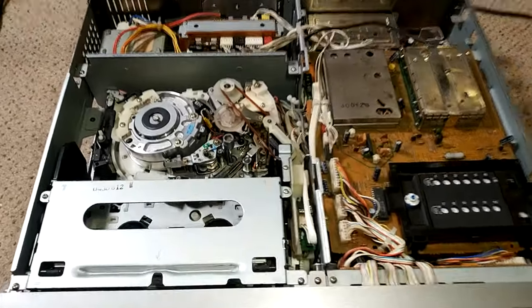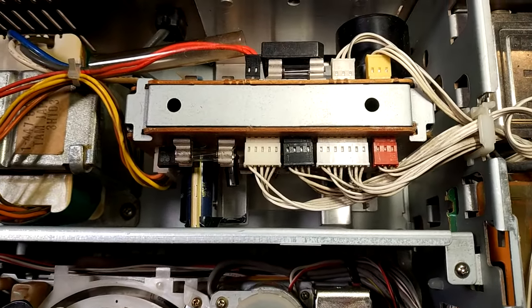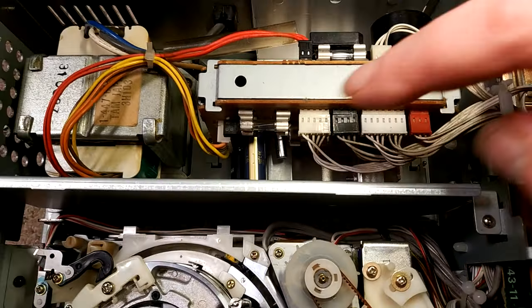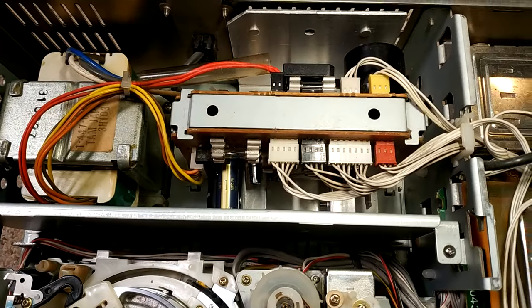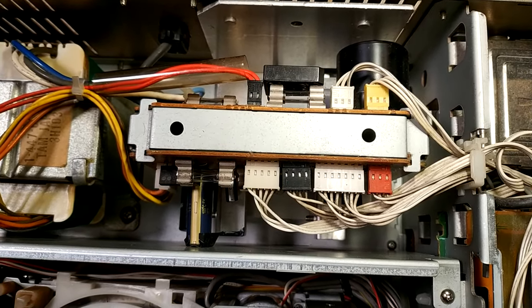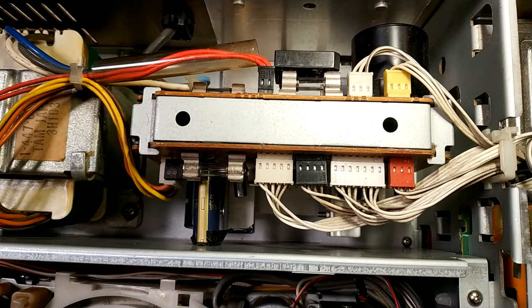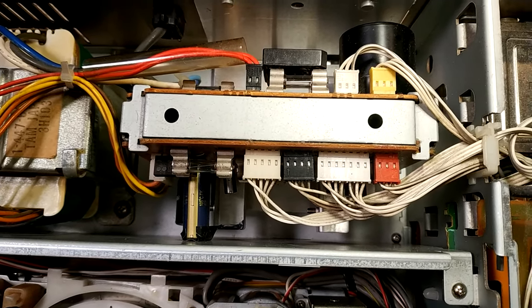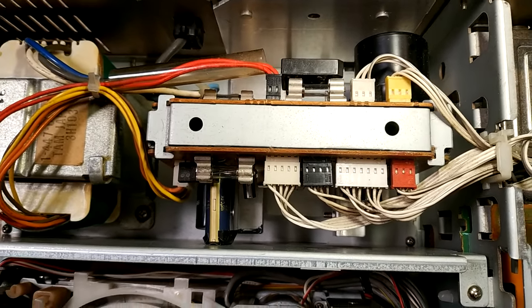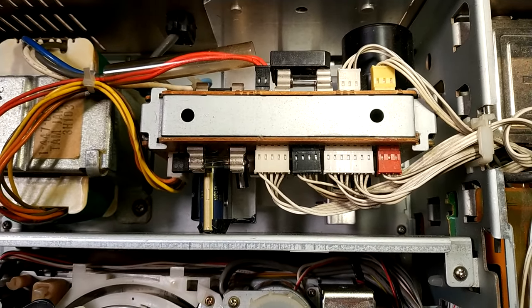So the power supply is all done. Changed quite a few capacitors actually in the end, and the majority did check either low or bad. I did actually have a bit of a problem with the 2200 microfarad capacitor, insofar as my replacement is just a lot taller. It's narrower but taller. The negative side of it is ground anyway, so I wouldn't really worry too much about it potentially touching the metal there. But I have put a couple of bits of tape over the top, just for the sake of doing it, really.